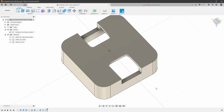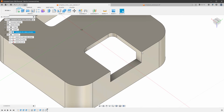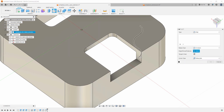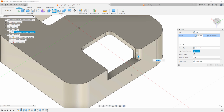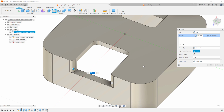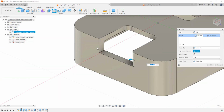We also want to avoid any sharp edges on the outside, and there are multiple of those. And one of the sharpest parts is this part, where you can see that everything is sharp. So we can try to round it at least a little bit. Select the fillet tool and select this line and make it slightly rounded, maybe like 1.5 millimeters. And use the same value also for this corner and those two corners on the other side. So this one and this one.